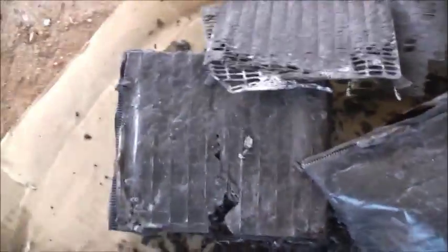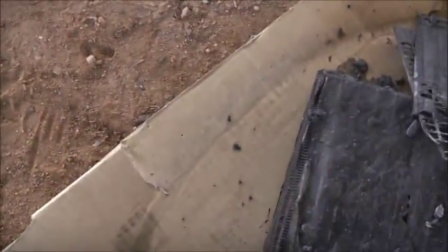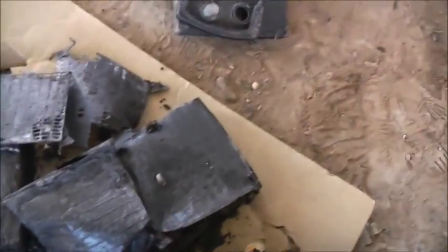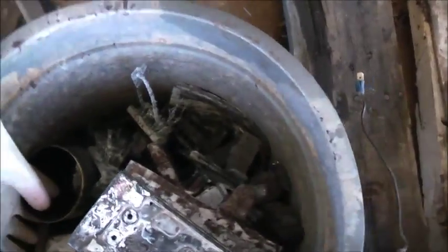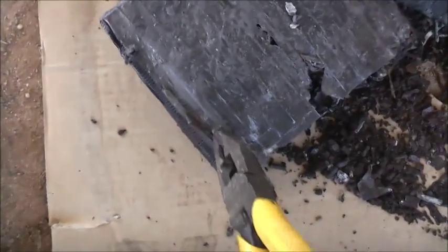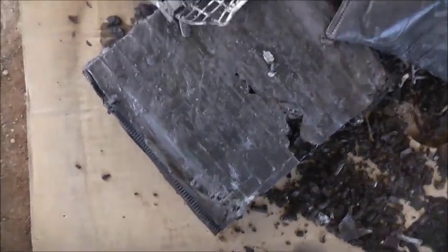So that's what makes a four-wheel drive battery a four-wheel drive battery, by gluing and securing all this in the case so the plates don't move and vibrate and break off internally. With normal car batteries, if you're a bush basher, paddock bashing, doing lots of joyriding over bumps and stuff, your batteries don't like it because those plates will vibrate and shake and break off at the interconnecting points. So here's what Exide have done to counteract that. They put silicone in all the gaps on both sides and in the case, and that's what's held these together, and that's why I couldn't pull them out. You can see a bit clearer there, the silicone.